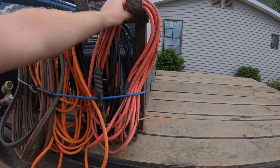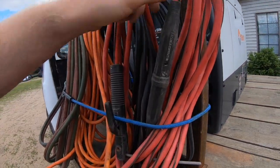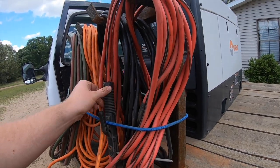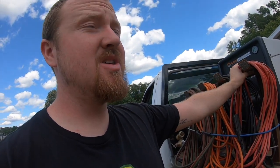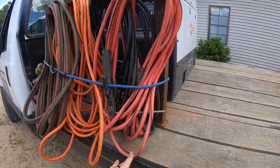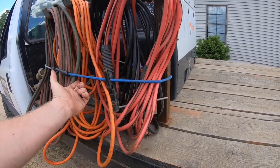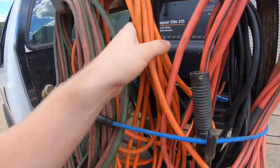On our lead rack, we have 40 foot of stinger — the red cable — and 40 foot of black ground. The stinger and ground come in 20-foot quick-connect sections, so there's 20 foot from here to the first quick connect, then 20 foot to the stinger. I'm going to get another one or two sets of 20-foot extensions with quick connects. The cheapest option I found was buying 20-foot heavy-duty jumper cables, nipping the ends off, and just buying the welding stinger, ground, and quick connects — much cheaper.